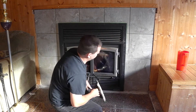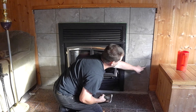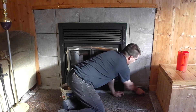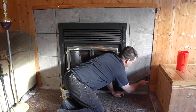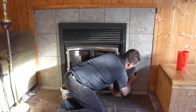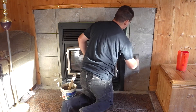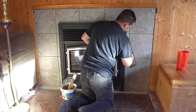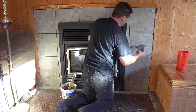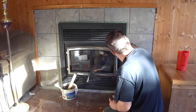Like I said, keep cleaning as you go. There's a red spot right here — the line goes like that. What I said about cleaning up: you can see there's excess product there. All you do is grab your grout float, come up at quite an angle, and that's how you clean it. Use the different sides of your grout float as well for tighter areas.